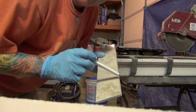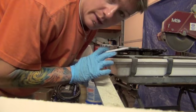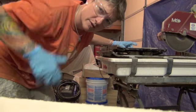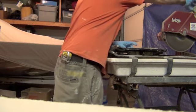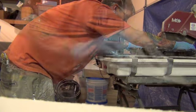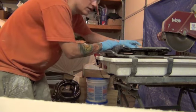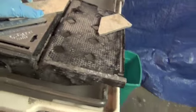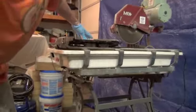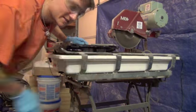Probably best to start at the tip of the 45, because if you go from the inside, it can actually chip out at the end. So earplugs would be beneficial. Also take your square, run alongside the guard, hold it like this as you go. That'll get you a good 45. As long as the tray is riding straight along the arm that guides it.